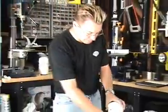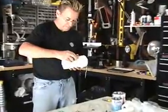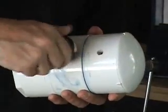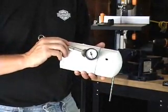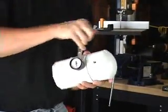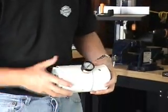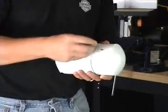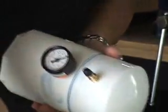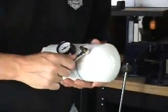The next thing we're going to do is put our valves together. It should have a little white box with a pressure gauge in it. This one you can screw in by hand — get it started, it'll thread in by itself. When it gets too tight, grab your 9/16ths open end wrench and take it all the way down. Line it up so it's straight. Next, we're going to take our Schrader valve, put that in, and start that one by hand. Grab our 7/16ths and go ahead and tighten this one — it'll thread itself in as well.